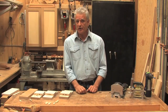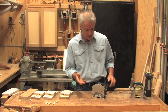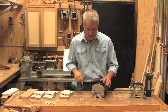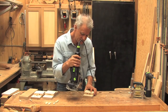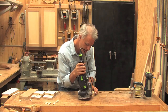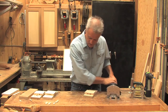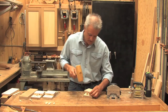Let's look at all the joinery options for this project. The Festool Domino, which is my favorite, is a high-end, very precise joining tool, which makes a joint by having a drill bit which wiggles from side to side. It is very well suited for something like this because, as you see with these collapsible points here, this allows me to locate the tool exactly where it needs to be from either side, and plunging two dominoes, which will be very precise, very tight, and incredibly strong.